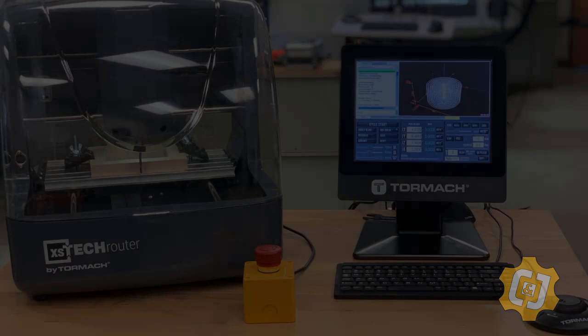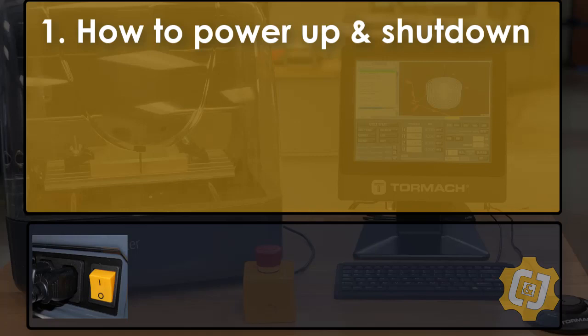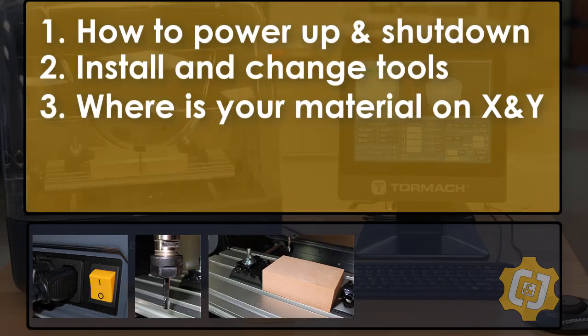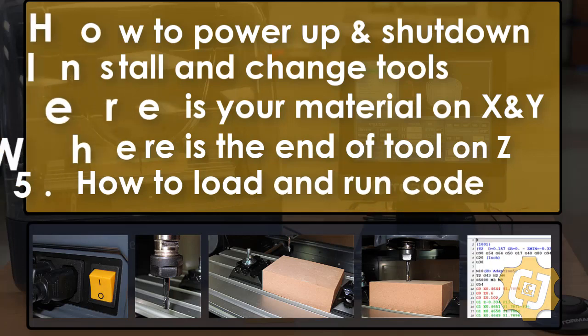In order to get any CNC machine up and throwing chips, we think that there are 5 essentials that you must know about any machine. Number 1, how to get the machine safely powered up and running, and also how to power it down safely. 2, how to install and change tools. 3, how to teach your machine where your part is located on the bed in the X and Y. 4, how to teach your machine where the end or bottom of your tool is on the Z in reference to your material. And finally, number 5, once you have some kind of NC code, how do you load it and run it?